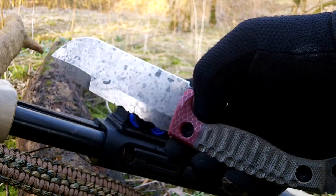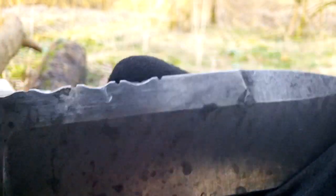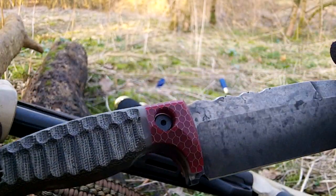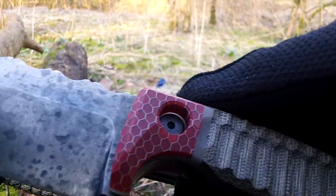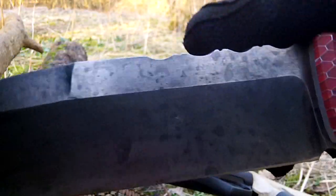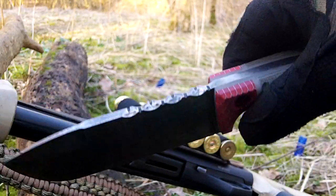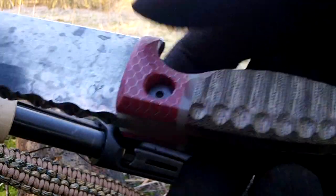It's definitely the most time-consuming Hellhound I've done so far, and one of the most difficult sets of scales with that CTEK — it's really risky, it tends to blow apart. That was done by hand as well, not with a mill, using a carbide burr and a rotary tool. The price will reflect the time that's gone into making these scales, putting the finish on the CTEK, and the finish on the blade. It's 6mm D2 — the only one in existence so far in 6mm; the rest have all been 8mm. I did want to keep this for myself, but when we're moving, needs must.